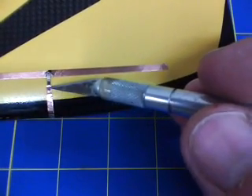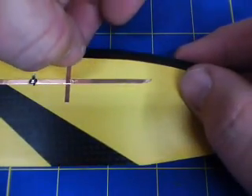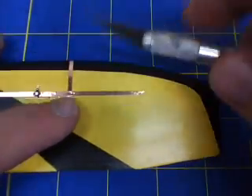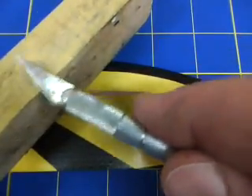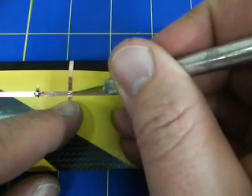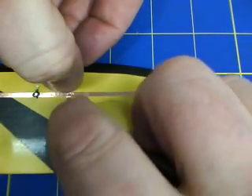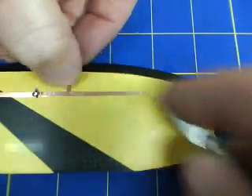Show a little technique here. I've taken my copper and slid it right up to almost underneath the resistor, wrapped it around, using my thumbnail to press it along. I came across here. I'm going to take my very sharp blade — I've taken it on a sanding block and put a nice sharp edge on it — and all I'm going to do is score right across here, use my thumbnail to hold that down, and pop this up just like that.